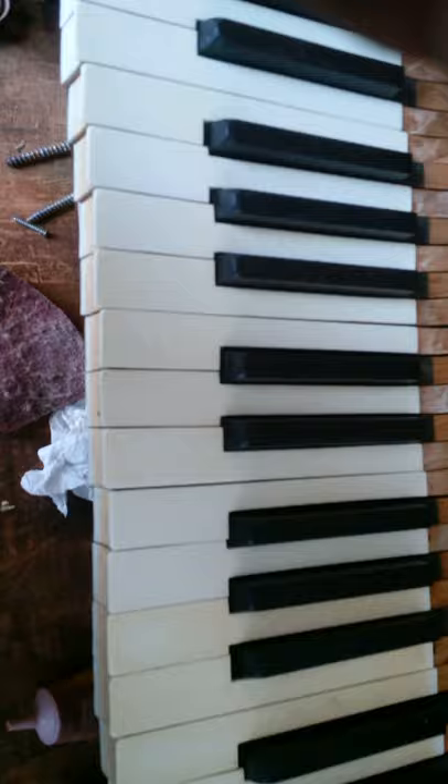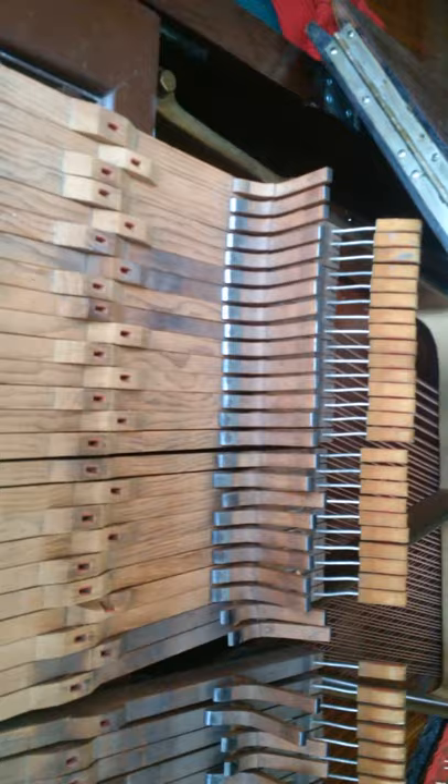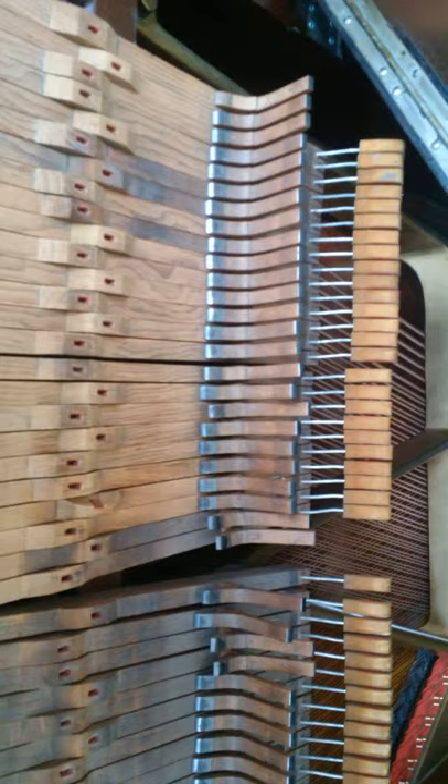Finally, I put a little bit of hydrogen peroxide on, which takes off all the residual stuff, and then buff them on the buffing wheel and they will look like pearls, like they were original. Now this piano — as you can see — has a very old action. This is a Brown action that comes from a Chickering piano, and that's what this is: a Chickering Concert Grand, six foot six, purportedly from 1840, though I'm still trying to verify that.